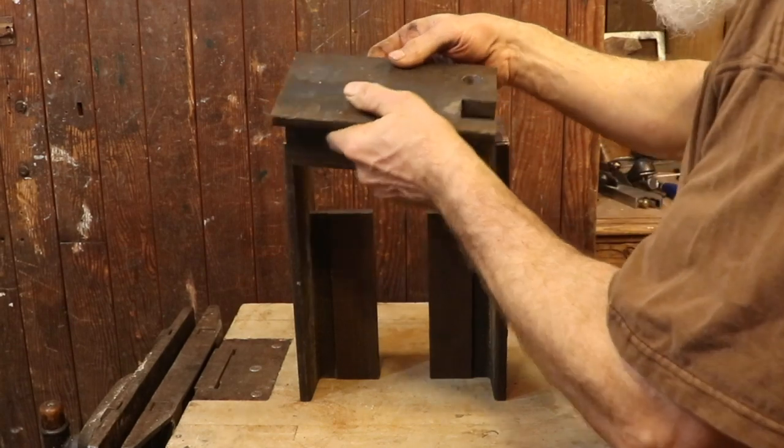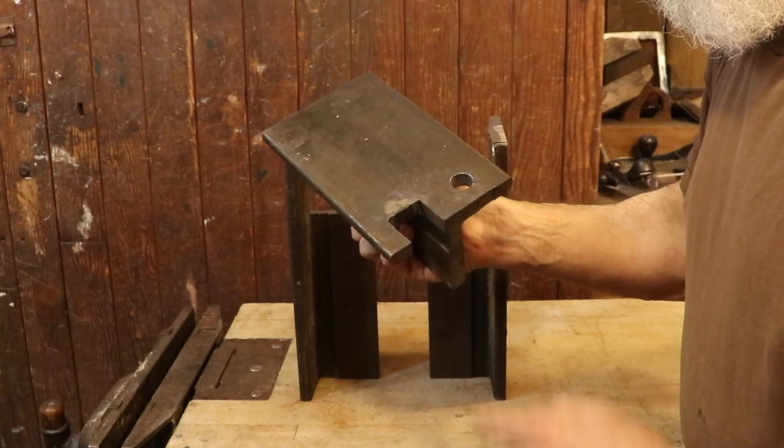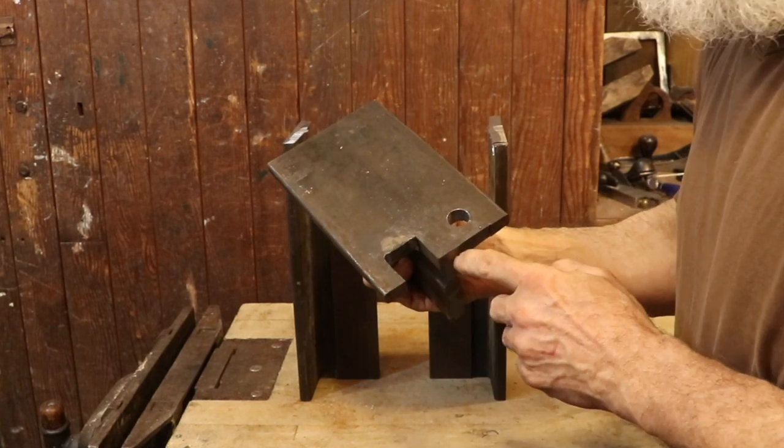You can see how this arrangement has allowed me to take a pretty simple approach to making the hardy hole. I was able to saw in the two sides and then just drilled out the material between those two lines and knocked out that slug. The notch is wide enough to fit around my grinding wheel on my bench grinder, so I use that to smooth out the base of the notch.